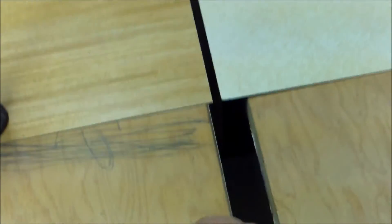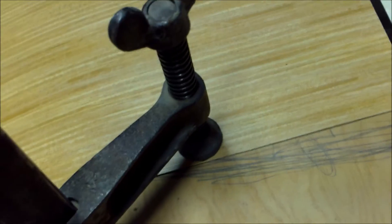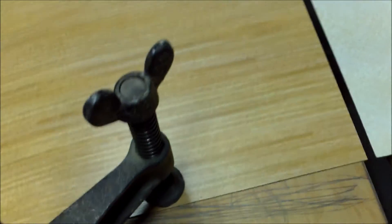Now, the direction I want to feed this — I want to feed it from this side going through. That way the cutter will have a tendency to pull and keep the roller against the side. You want to make this in one continual cut through. I put a pencil line there, so even if they were at two different locations, I'll use that pencil line to line it up. Make sure the Formica is nice and there's no debris on there.